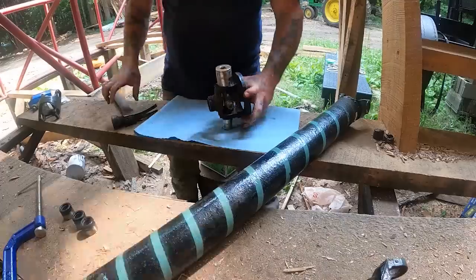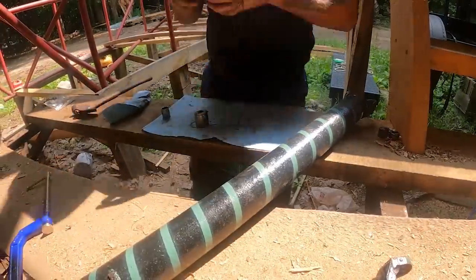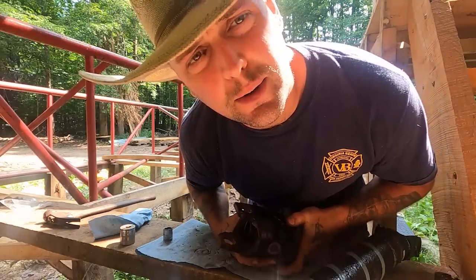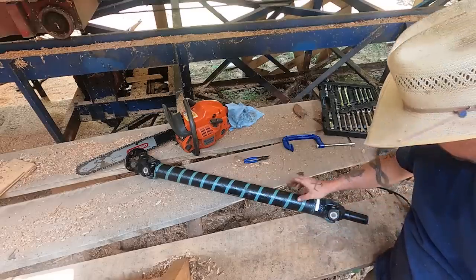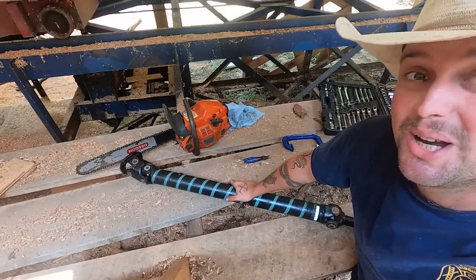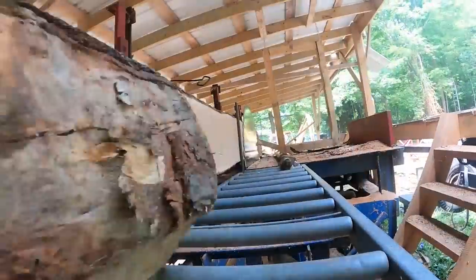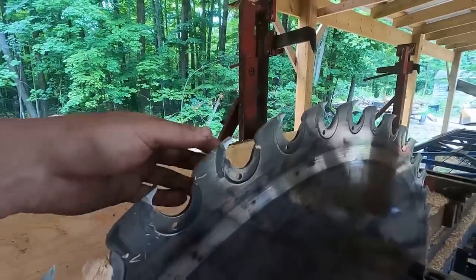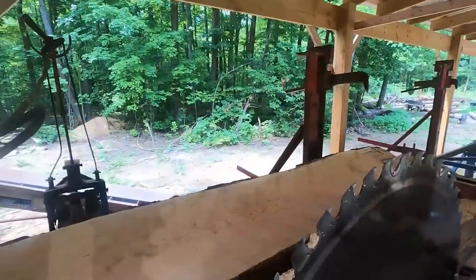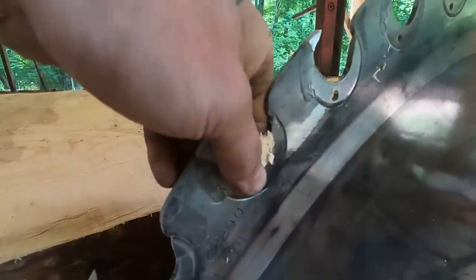One nice new wobble doofer — I would like to know what the real name for this thing is. Let's put the rest of it together. It's all back together, everything's moving pretty good. Now we've got to put the shaft back on and get the log pried off of the teeth it's buried in, and we'll try it out. I think our blade is okay, but I want to make sure I inspect it really closely because that's a lot of force — the outside of this blade is spinning at 88 miles an hour. When it grabbed on four or five gullets it stopped immediately. This one's already been broken off before and they welded it back in place, but it's still in good shape. I think we're safe to fire it up.